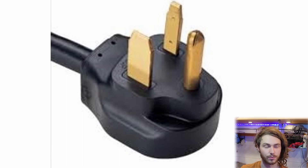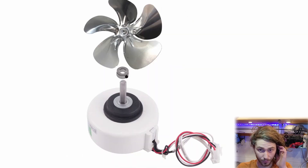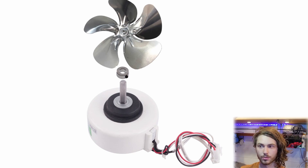I replaced the 6-50p plug with a 14-50p plug, for multiple reasons. The first being to power the fan motor. After welding a new fan bushing onto a scrap fan from the junkyard, the fan motor was ready for operation — it just needed to be wired first. The original fan motor was 220 volt, so it could just be wired directly to the black and white at the back of the power switch. All I had available was a 120-volt fan motor, so I needed a neutral conductor to power it, since 120 volt at minimum requires a hot and a neutral.